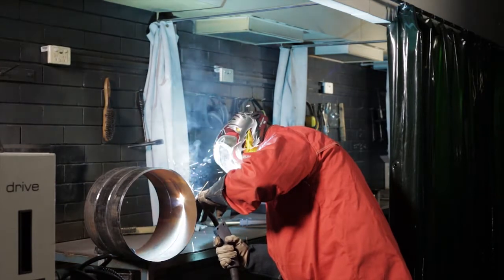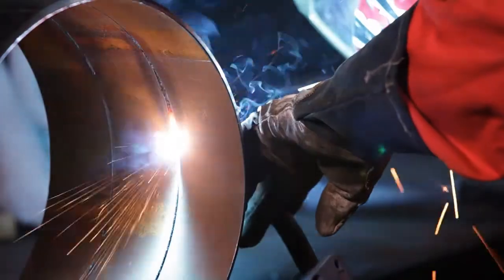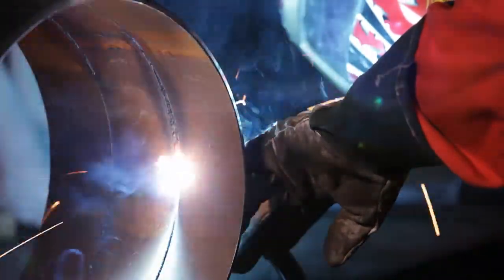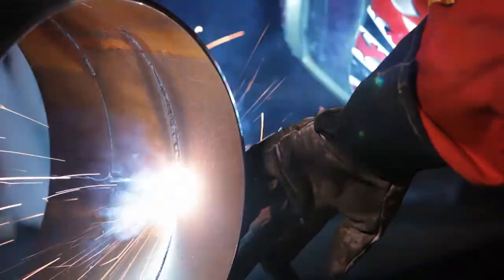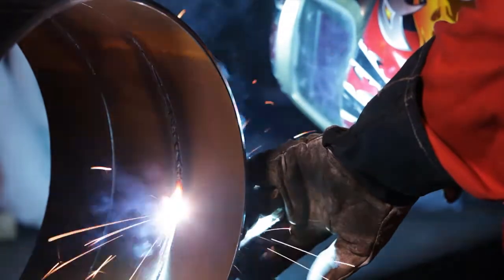If you're out in the marketplace as a welder — especially those doing drag line boom cord welding — excess penetration can fail your job. This machine monitors your background and will give you an excellent back bead all the way through. Minimum penetration — this is what these waveforms are dedicated to.